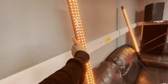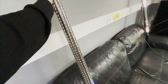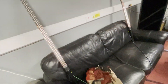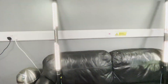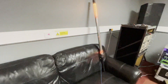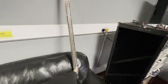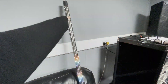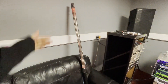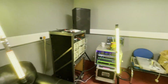I've built these - they're five meters of tape each, so that's five one-meter strips, one meter top to bottom and five wide, so they turn into a 60-tall by 5-wide LED matrix each. You can run them as lights if you want. You can build them in MADRIX, though I'm not the best with MADRIX - building the profile for them was taking me a while, just because the pixels snake up and down the whole way. It's really easy if you have them all coming top to bottom, but that's not how I built or wired them.